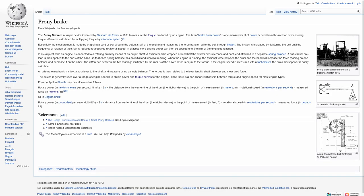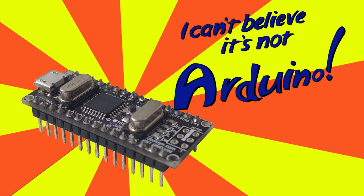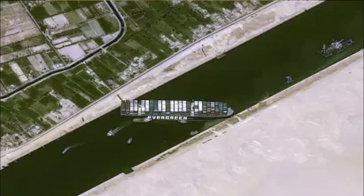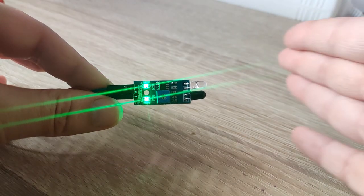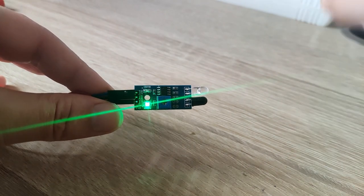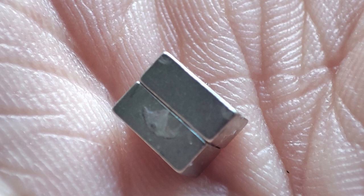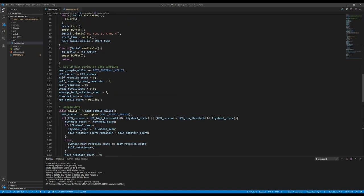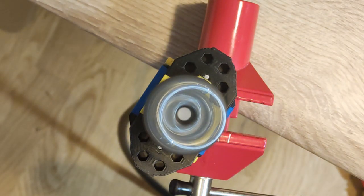I had the necessary Arduino module, a load cell, and a HX711 load cell amplifier module on hand, but the photo interrupter was nowhere to be seen. I did have an IR LED-based distance sensor available, however I found that it wasn't quite up to the task. So I decided to use 49E linear Hall effect sensors and two neodymium magnets that I got from disassembling old CD readers, in order to make the setup for measuring RPM. The schematic and code for the dynamo are up on GitHub — link is in the description. I also added some radius and weight to the flywheel to make the engine operate a bit smoother, after which it was time to make some runs to measure the engine's performance.